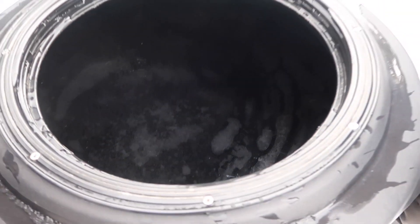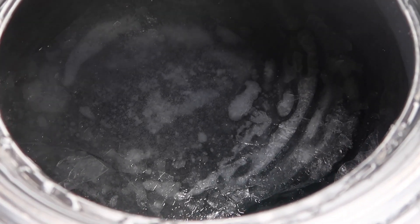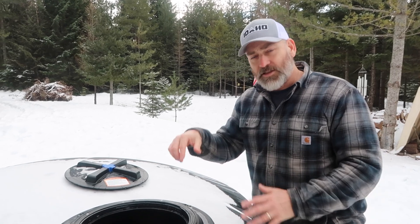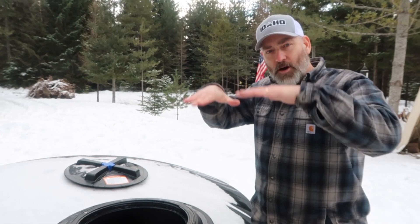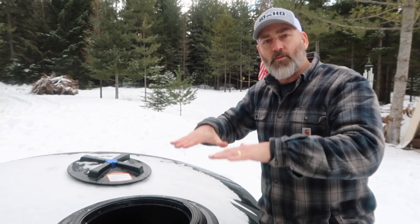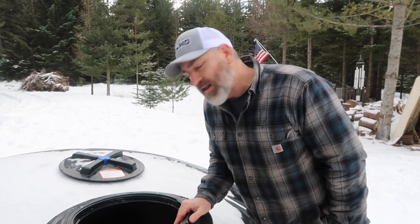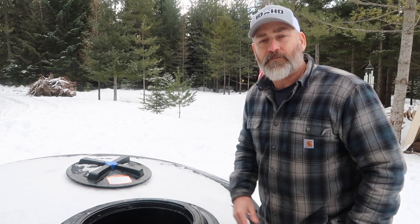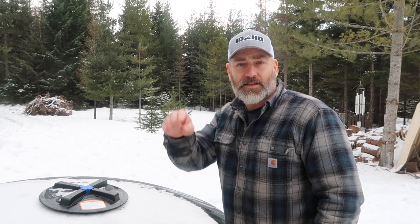There's a layer of ice at the top, but actual water you can still use beneath it that the pump is drawing out. Even with the ice on top, we don't have any problem pumping water into the house because it draws from the bottom of the tank. As the water level goes down, the ice goes down with it. If we filled it back up, water coming out of the well can be around 40 degrees, so it would melt a lot of that ice. The pump is actually in the crawl space under the house — the pipe connects at the bottom of the tank, runs three feet underground, goes under the house to a pressure tank and pump that pressurizes it for the house.